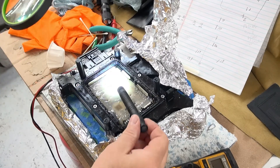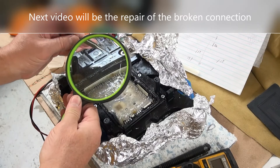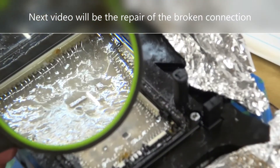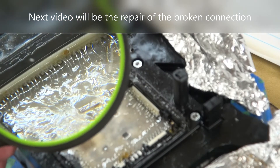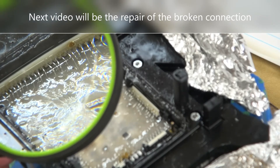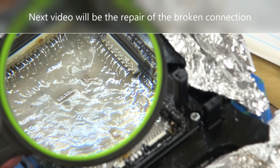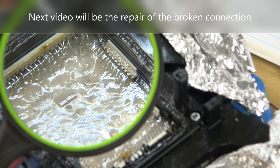Let me zoom in — there's the second wire right here with some potting compound around it. The potting compound is very elastic and very soft. I can move it out of the way but it comes right back, so I'm having to figure out a way to pull it away and trim it very gently because the wire is very fine. It's almost laughable how delicate this is — I can't imagine why they wouldn't have made it more robust. But that's what I'm faced with: soldering that one wire back on, and then I believe this module will work.